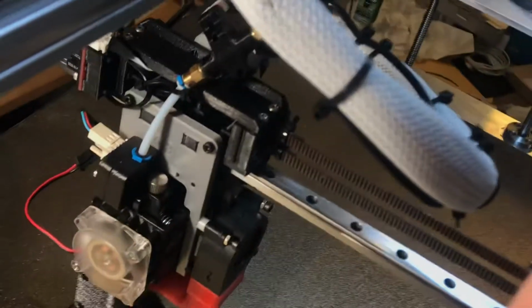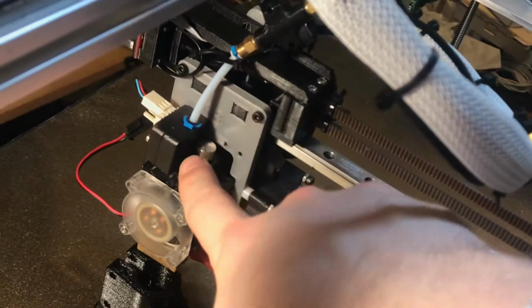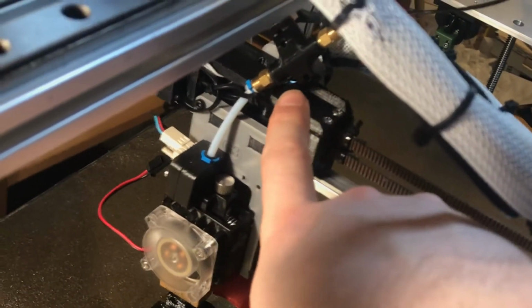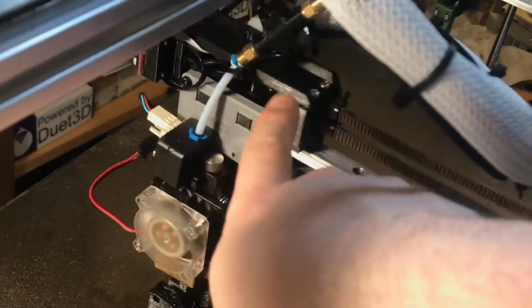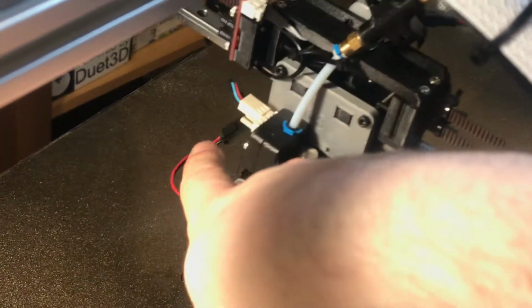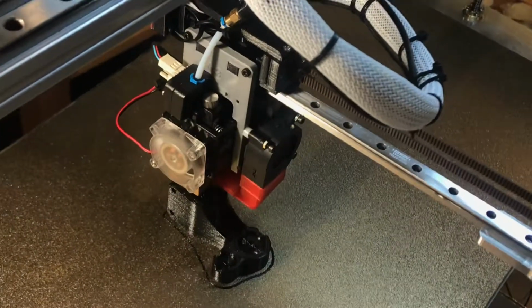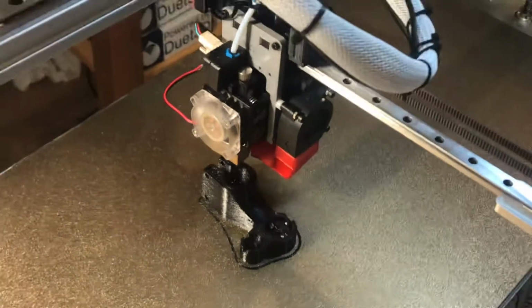But this little advanced notice runout sensor helps you in the exchange of changing filaments if it does run out in the spool, as this jam and stall detector has to operate by viewing a lot of printing over time and averaging that out to detect if there's a stall or jam, so it's not always instantaneous.